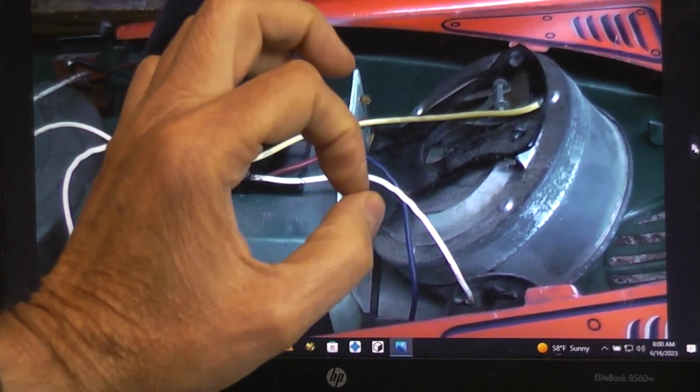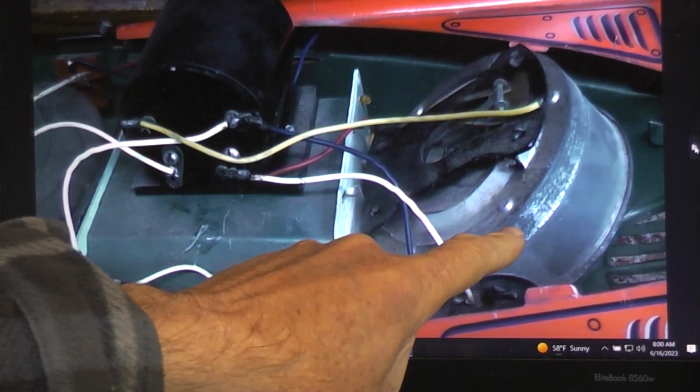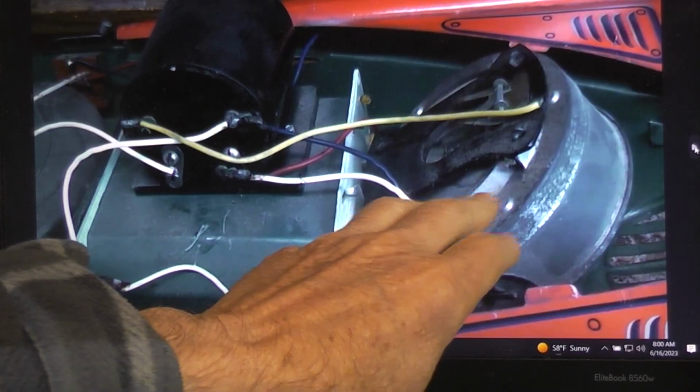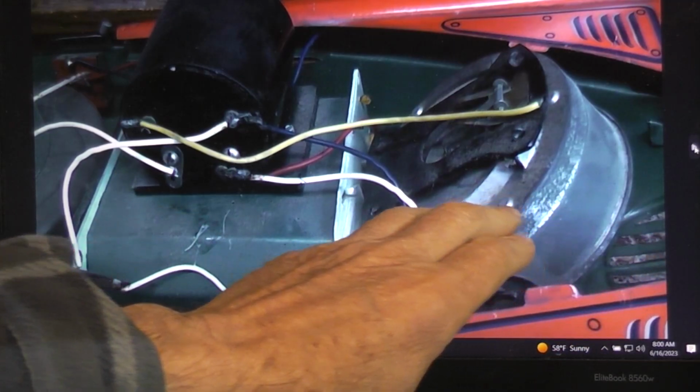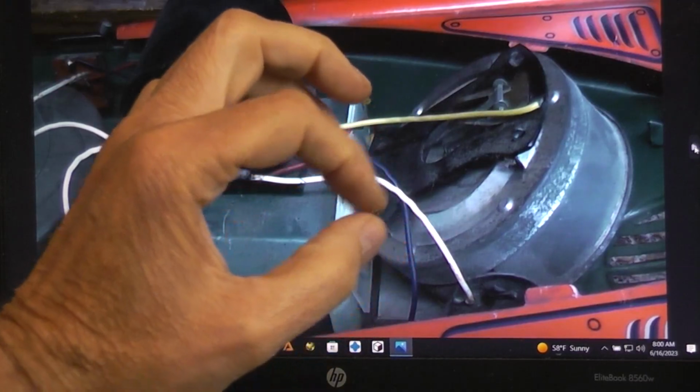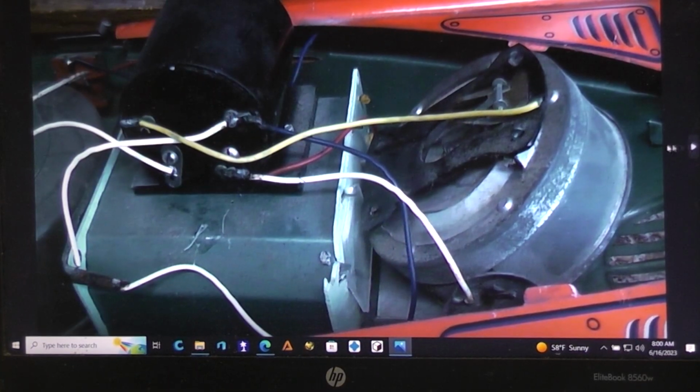And normally, with nothing happening, the wiper would touch the can, that would close the switch. When a tone of the proper frequency enters this chamber of the Helmholtz resonator, it resonates, and that'll cause the two contacts to vibrate. The switch will be opening and closing.